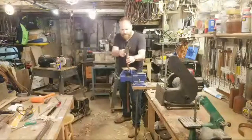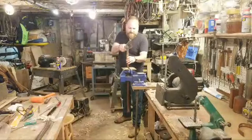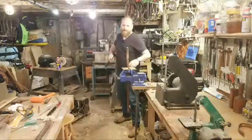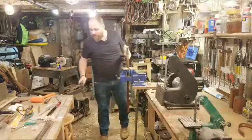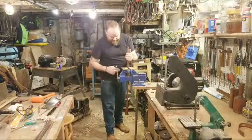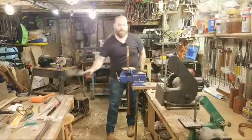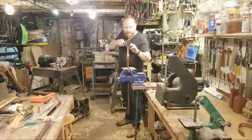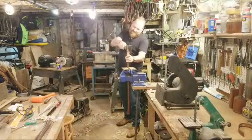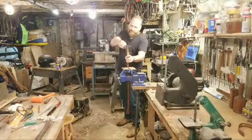That's one of the things that Buck and Billy Ray does that someone mentioned earlier, is that he uses a hacksaw blade, and he'll put it down inside once he has the head on the axe handle. I'm always surprised that he can keep his kerfs that open, which makes a big difference. If you're able to have your kerf open, then it'll accept a lot more wedge, which is the whole point.